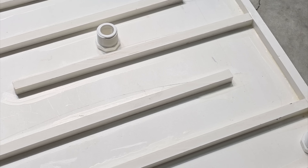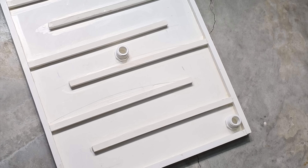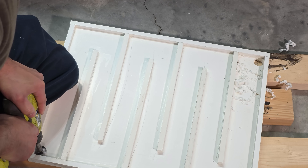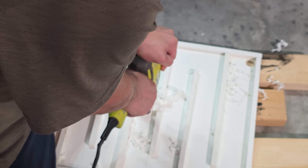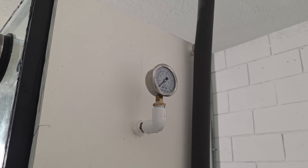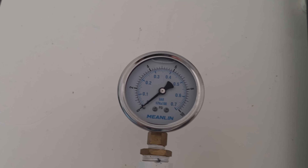The real breakthrough came when I imagined the water moving through the heat exchangers as if it were flowing through copper pipes, but without the pipes. So I added baffles to the heat exchanger that would cause the water to snake through the panels, similar to the copper pipes it was replacing. This allowed the water to travel directly across the glass, which spread the cooling fully across the surface and increased the responsiveness of cooling. It also improved the panel's pressure tolerance, resisting the panels from blowing out.